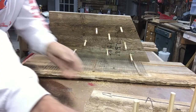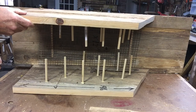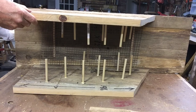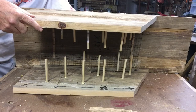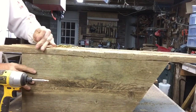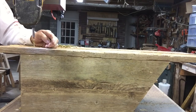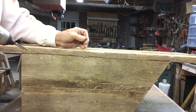I'm going to position this four inches from the bottom, then attach the bottom with two-inch deck screws. This wood is very soft — it's cypress by the way — so it's not necessary to pre-drill, and it's not going to take a lot of screws, maybe four.